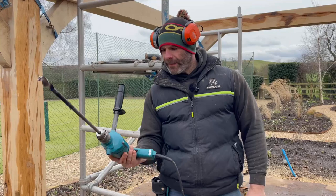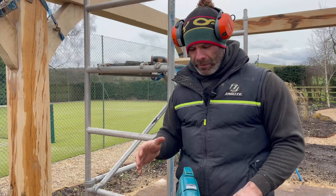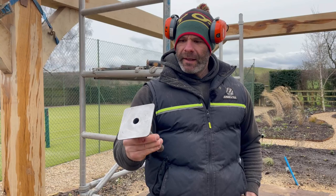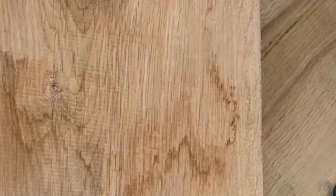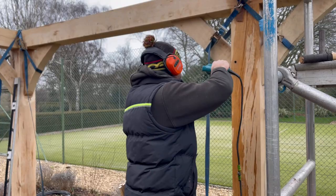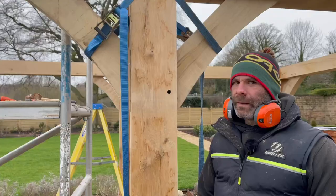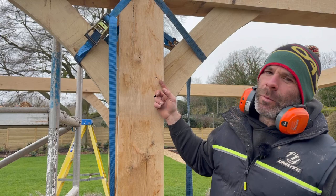It's quite dangerous as well because it has no clutch. The oak that we're going to drill is quite chewy and it takes a lot of getting through, and that's what this little thing does. To keep the hole straight we use this — a drill guide that I had fabricated many many years ago. We don't let that big drill burst all the way through the post, just the threaded tip. If you let it come all the way through it leaves a bit of a mess, so we finish it off from the other side with the same size drill bit on a cordless.